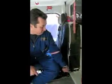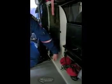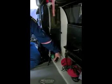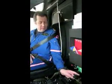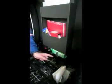The crew cabin fire extinguisher is located behind the number 1 seat at the bottom of the shelving unit. A black strap holds it in place with a snap. Undo the snap and remove the fire extinguisher from its compartment. A second fire extinguisher is located in the cockpit. It's mounted by a strap at the aft part of the lower console.